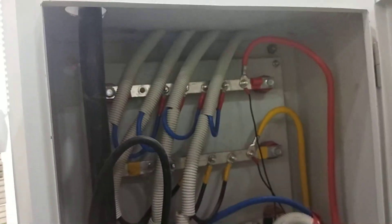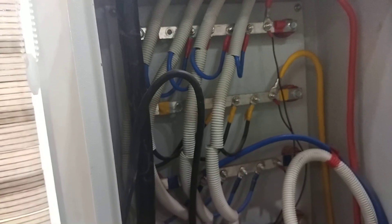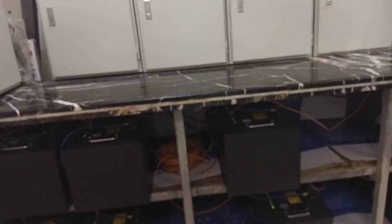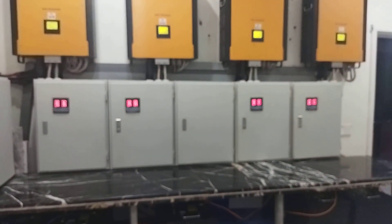Let's look at the input and output cabling. The main cable is 35mm² and the connected cable is 10mm². For connecting the battery bank we used 25mm² cable, and the flexible main cable is also 35mm².